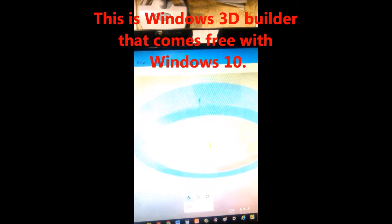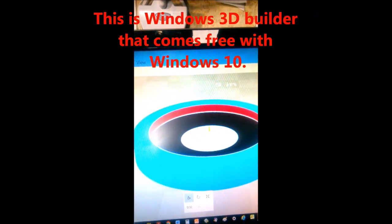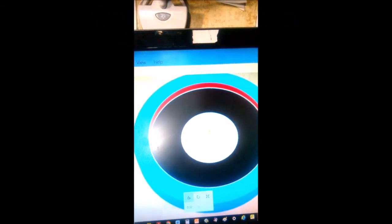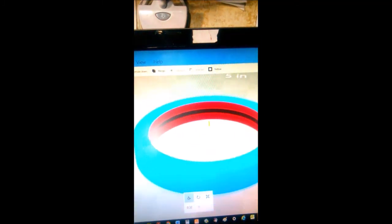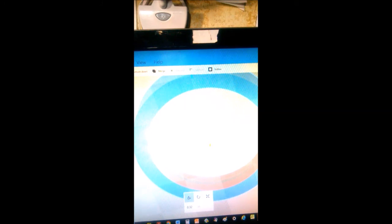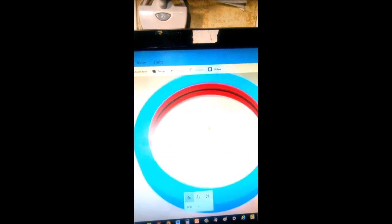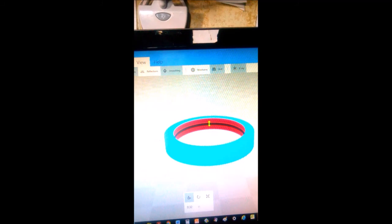Here it is looking from the floor or the bottom. You can see the area here is the same. Now we don't want to print off this big flat O-ring. So what we'll do is go to edit and subtract it. Okay, now instead of an O-ring, we've got a groove in here. We've got a groove that's 0.2 inch thick, and it goes back into this wall far enough to hold that O-ring. Okay, I hope you're able to follow all that. And we're ready to print.